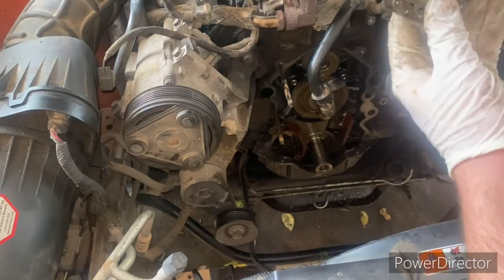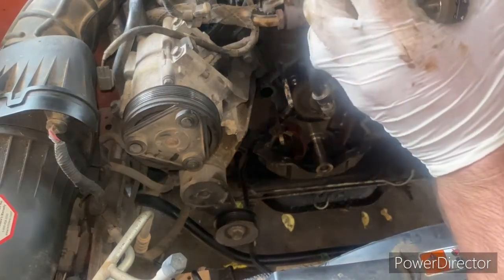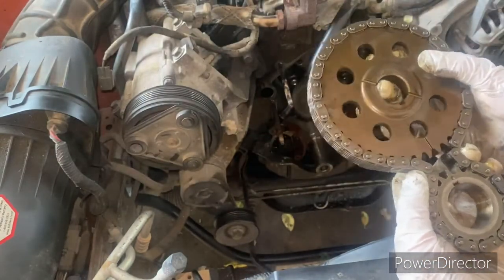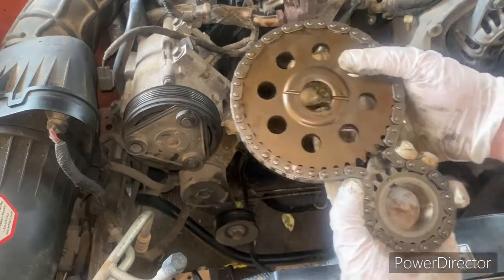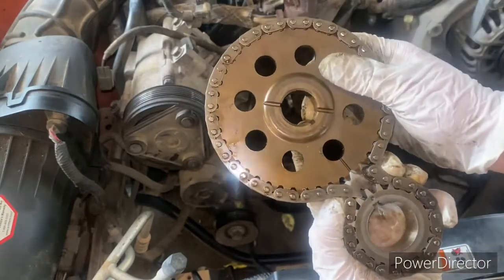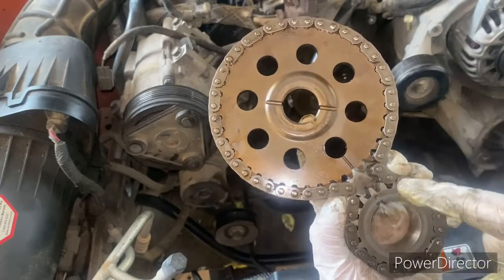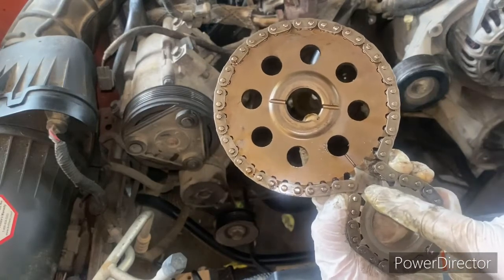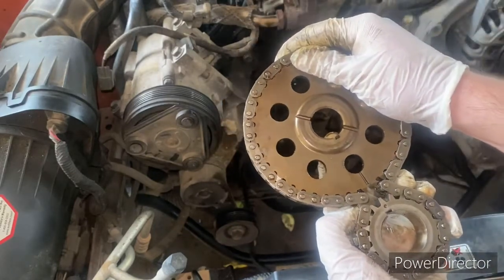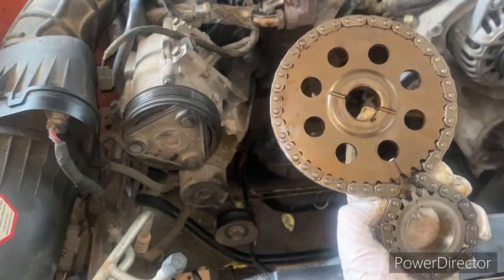Here we've got our timing gear. Something I was looking at on the new one — if you bend it just like this to the locator, you can see there's one tooth here, one tooth here. There's a tooth that'll fall in this hole, a tooth that'll fall in this hole, leaving these two without a gear and this one without a gear as well. That'll be a good way to show if you've got your timing gear and your other one lined up with each other.